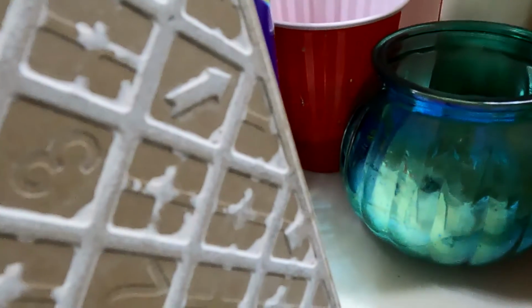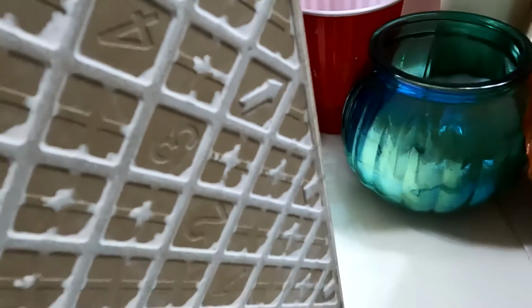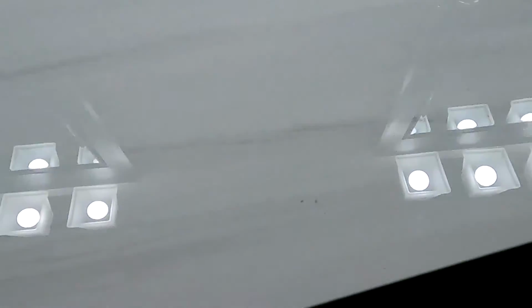And there's the arrow. A lot of good quality tile is going to have an arrow. It's kind of a cheat sheet. It doesn't always get the veins matching up, but if you just follow the arrow with all your tile, then you're pretty good to go. But that's never definitive, so you always want to match up the best you can.